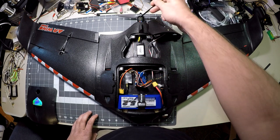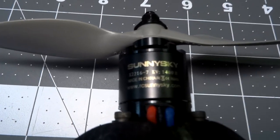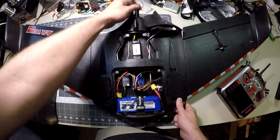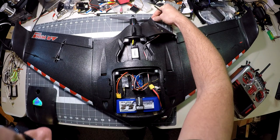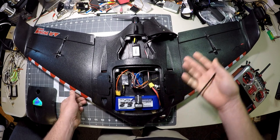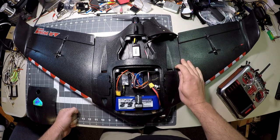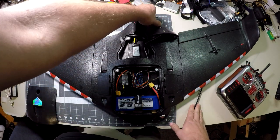The power leads run back to the motor. The motor included is a SunnySky 2216-7, which is a 1400KV motor. I'm currently running a 7x6 APC-E prop. It came with an 8x5 composite prop which ran fine and made good power, but I wanted the 7x6 for a little more pitch speed — it does seem slightly more efficient, so that's the prop I've stayed with.